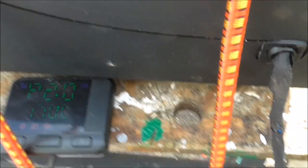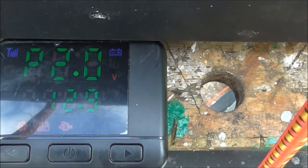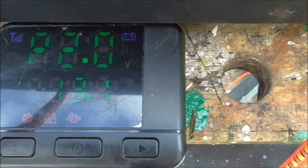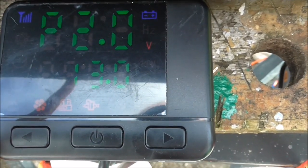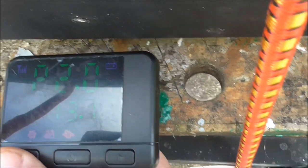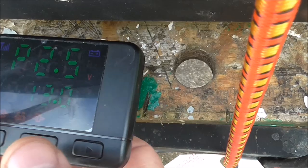I like this controller. One of the reasons I do like it is you can go in and see what the settings are, but you've also got a decimal point. You look at voltage there now with a decimal point. With the new ones, all you're getting is 11, 12, 13. But if you see 12 for a battery — a lead acid or deep cycle — you'll say that's a flat battery. Whereas if you saw 12.6 or 12.8, you'd say yeah, that battery's good. So you can bring it up in better graduations — 2.2, 2.4 — rather than this one H1 to H6.